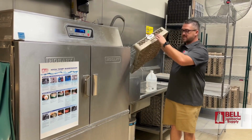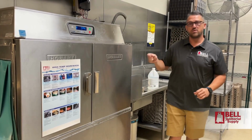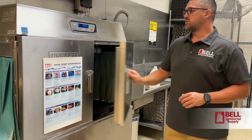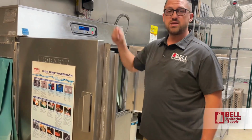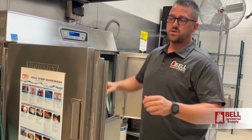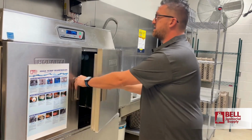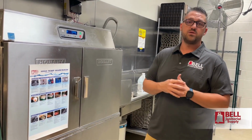And then you run your deliming cycle for about 15 to 20 minutes, check the machine, pull the rack out, or push stop, open the doors. If you have leftover lime or sediment, it should wipe off right away easily with a rag or a sponge, but it will come right off after the deliming cycle is being run. I highly recommend we do that at least once a month. With your guys' soft water and our soap dispenser, you shouldn't have to do more than that.